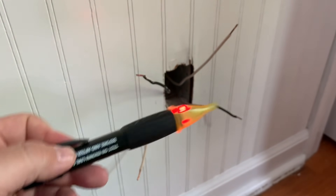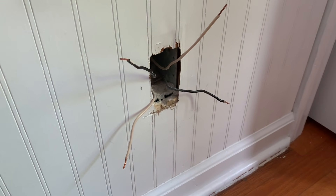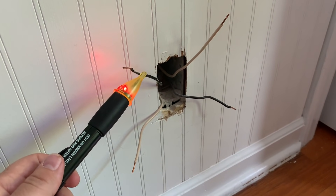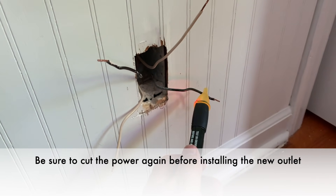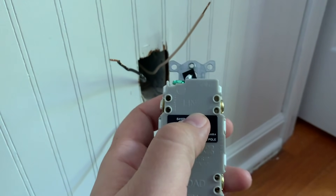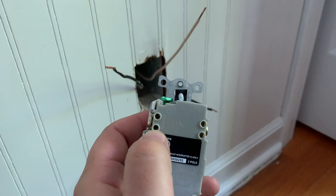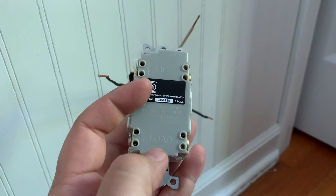Here's our testing pen. It should be the black wires that go hot when power is applied, but we'll test all of them to be sure. We flip the breaker back on for this circuit to see which wire lights up. The white wire is neutral and should not have power — and it doesn't. The black wire does have power. Now that we know which line is hot, we hook up the line side — where the power is coming from — to the GFCI outlet's line terminals, using either the set screws or the slots to slide the wires in and tighten them down. On the other side, where there's no power, we hook it up to the load terminals, and that's what will protect the other outlets.